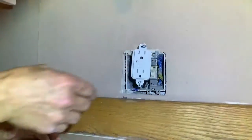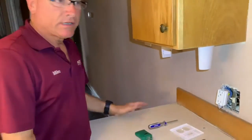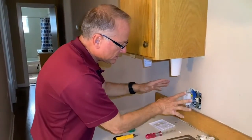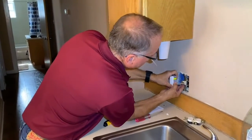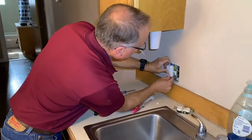That's basically all you do. Now again, if this GFCI were going to protect the next receptacle in line, then we would hook those wires up here, but it's all by itself. So you just need to adjust these wires a little bit so this can push back into the box.